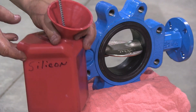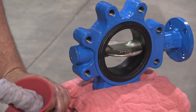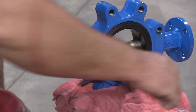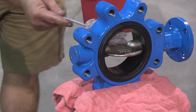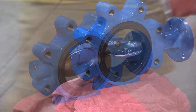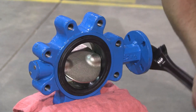Apply appropriate lubricant to the seat. In this example, we are using silicone. Some facilities, however, require a silicone-free environment — care should be taken. Rotate the top shaft several times with the assistance of a crescent wrench.